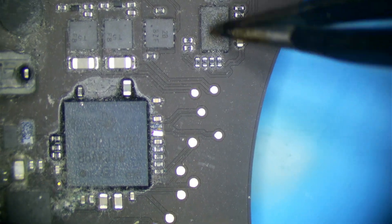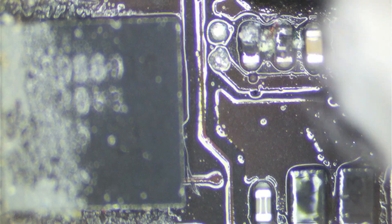Moving to the other side, here's another TBT ROM — very dusty, the same kind of thick moisture-laden dust. This is dust that has had material condensed into it from the air. Looking more closely, there are two resistors under here and these resistors do not look like they're in good shape at all. The corrosion is thick, calcified, and hardened — the kind that can actually bridge connections and cause real issues.